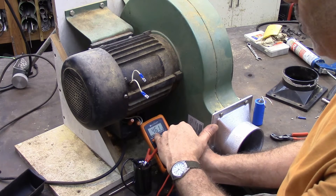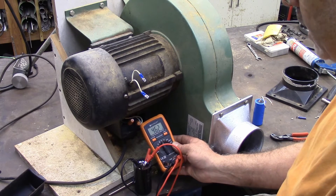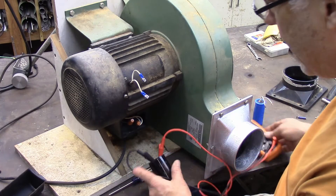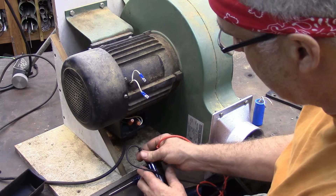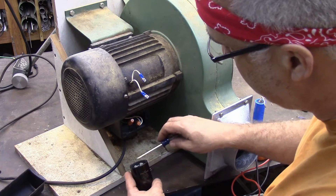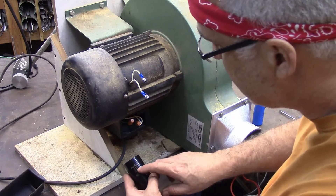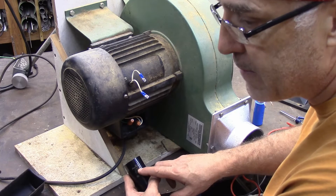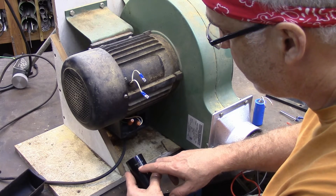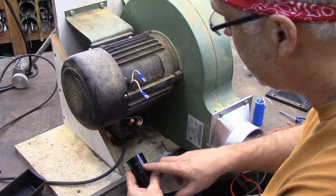It's telling me that it's at 461, so it's right within the range between 400 and 480. Now the other thing about picking a capacitor — this MFD, if it says UF, that's the same thing as MFD. So if you find something that says 400 UF, you've got the thing you need — it's the same as MFD.